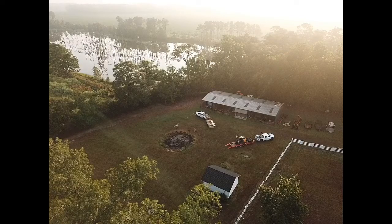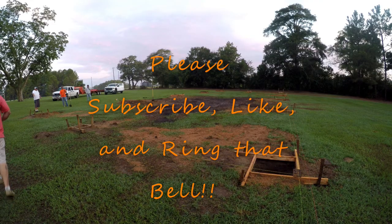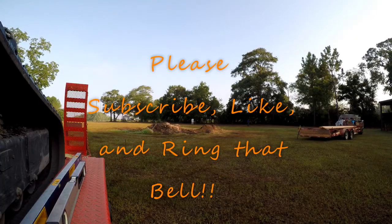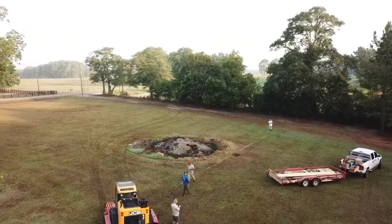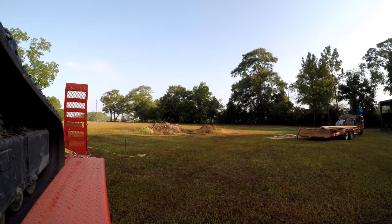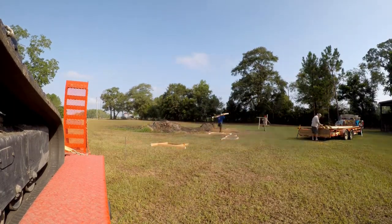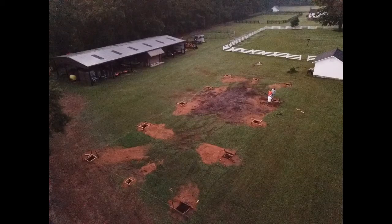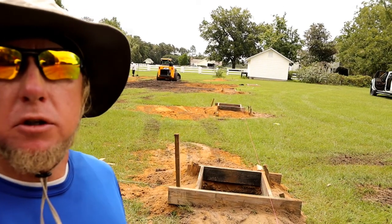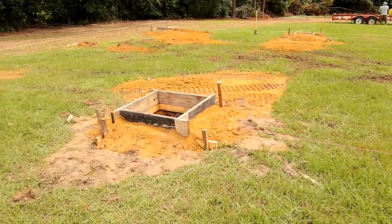Welcome back to the channel. Today's episode is about digging piers and laying out a foundation. We're fixing to build another equipment shelter — you can see the one in the back. We're building one in the front, closer to the road. We've pulled string, squared it up, and now we're building our boxes out of wood for our piers. He wanted to drop these piers close to the original elevation and just add additional footage or inches to each column.